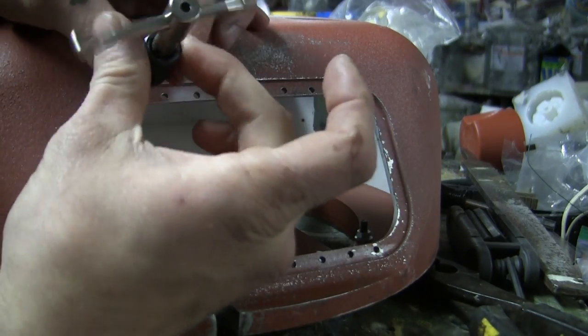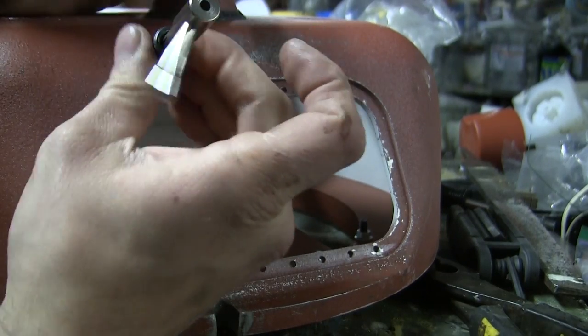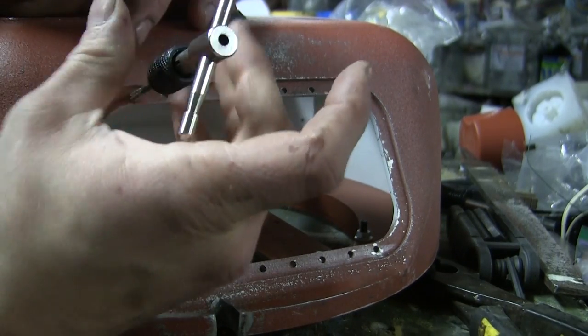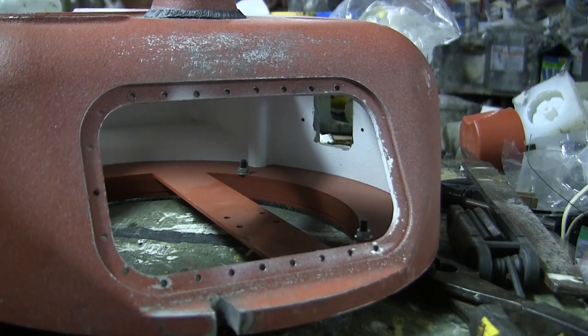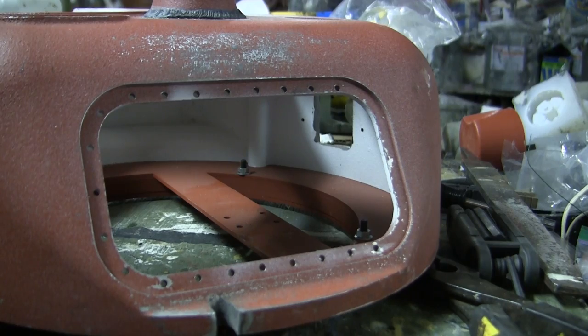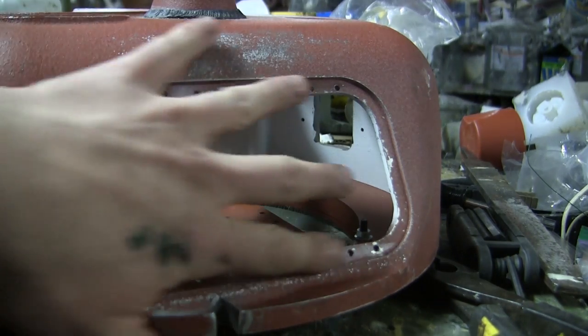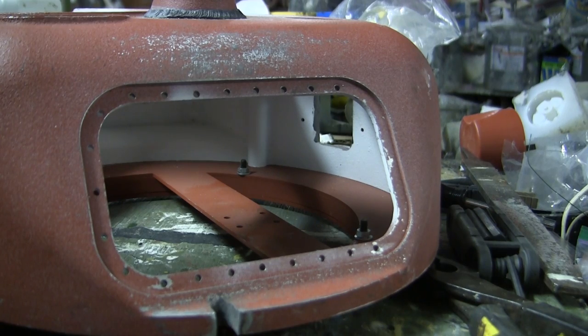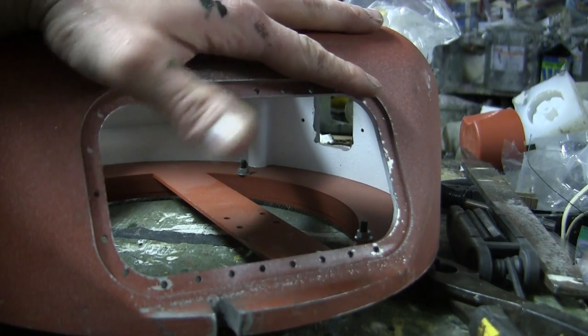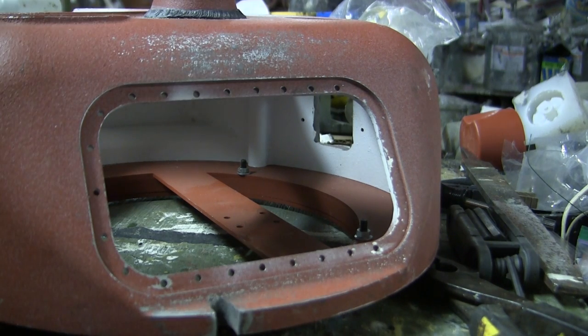Now, also, like I mentioned in a previous scene, since the fasteners that I will be utilizing will be standard imperial slot screws, I went ahead and utilized the same tap that I did for the mantlet and the rotor in order to mount on the same fasteners for this location here. As on the real Sherman, this component here is actually held on with real slot screws as opposed to hex heads or even Allen bolts.